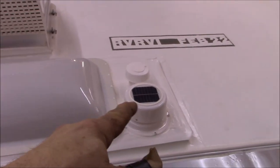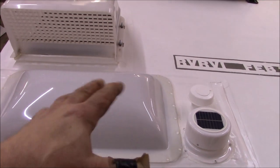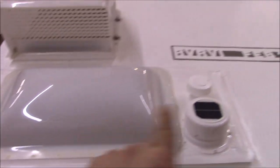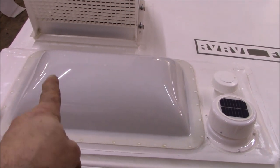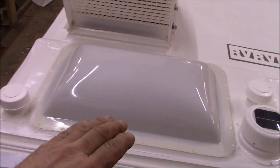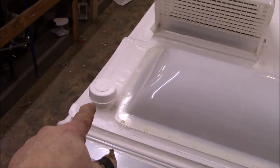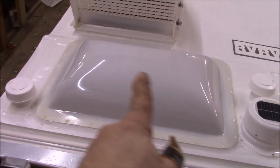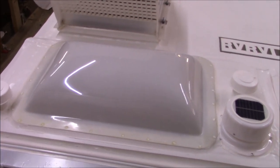We got a new skylight lens. This is a solar exhaust fan. A lot of the damage right around here was probably two-part: one being that condensation builds up on the outside, and on the inside there's still condensation with nowhere to go. When the sun comes up and evaporates it off, all the moisture underneath — that frost and condensation — will drool down, and the roof deck wicks it up into the framing. This is the intake right here — there's a trough in there, and when the solar fan kicks on it draws all the air up around the inner lens, keeping air moving through there, which should rid the condensation issue.